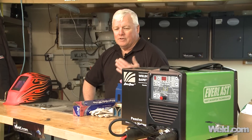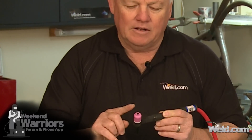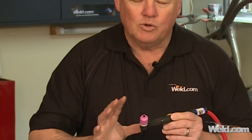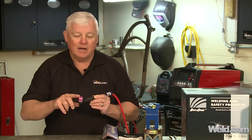We're going to start off with the TIG torch itself. Now, this particular TIG torch, I do have a gas lens in it. I have a 1/16th tungsten, and I may very well drop down to an 040 diameter or an 020 diameter. But right now I've got a very fine tip ground on this. And if you'll notice the gas lens orifice, it's only like a four orifice. Now the trick to low amperage is not to turn up your gas — it's actually to turn it down. So I'm going to be running at about five to eight CFH of argon.